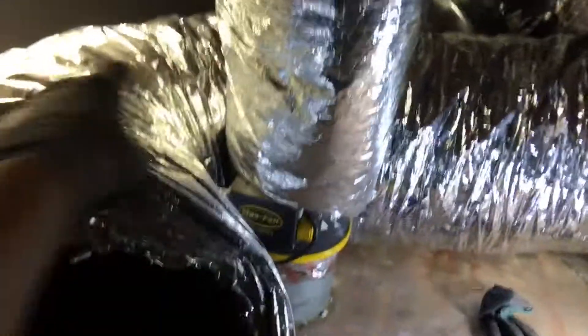When I pull it out straight and get it smooth inside - look how smooth it is now. Holding this towards me, I'm getting blasted with a ton of air right into my face. When this is kinked and making that hard 90, very little air comes out. But now that I've stretched it out and pulled it tight like this, when I connect it here I just increased the airflow. I didn't have to cut anything - all I did was route it around and pull it over. I have to do a little correction on there - you can see this one coming out here, coming around here. It's not too bad.